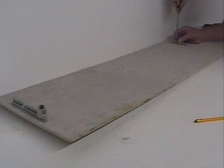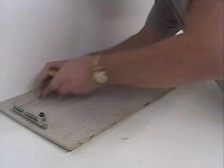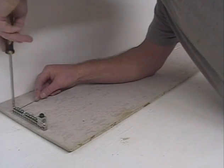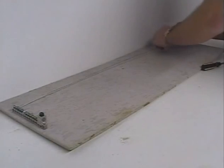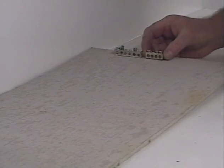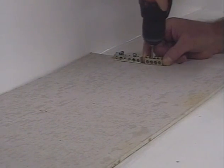Using standard breaker box ground connectors, we can cut these to our requirements. In our example here, we are going to have one set of 5 wires, a set of 3, a set of 2, and one single wire. These are all connected to one common ground on the left. The right-hand connectors must be cut up to disconnect each bank of wires from one another. Make sure that you leave a couple of connecting points extra on each bar so that you have somewhere to insert the bolts and the wires.